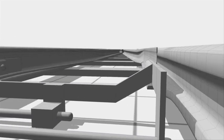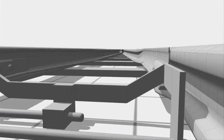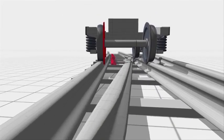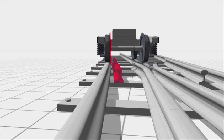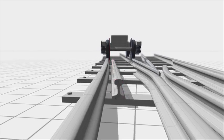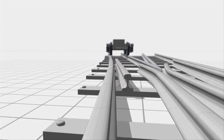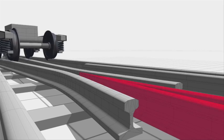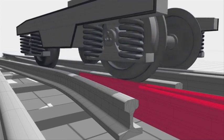In the reverse, the right wheel rolls over the switch rail and follows its geometry. The inside surface of the left flange is guided by the check, forcing it to follow the stock rail on the new route. And the right-hand wheel makes a crossing, again impacting a load on the crossing nose.